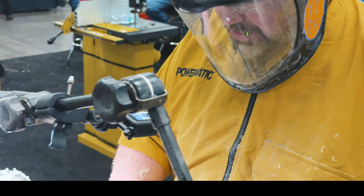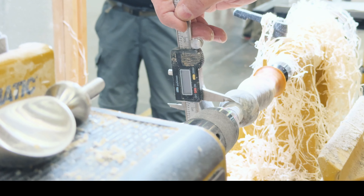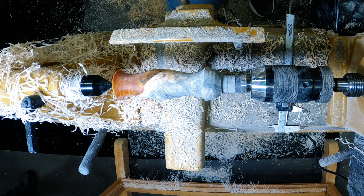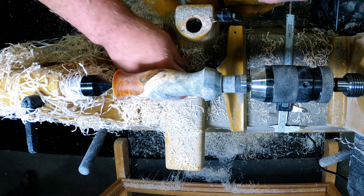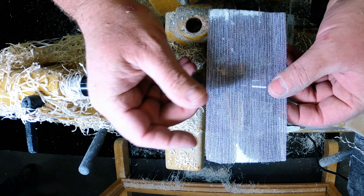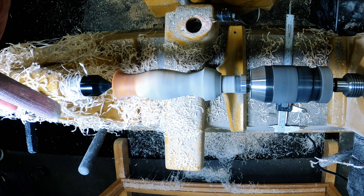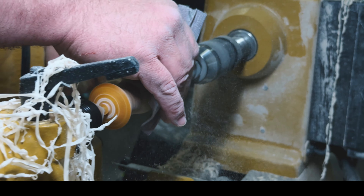One last check of the feel before we start sanding — yep, that's got a really good feel to it. Double-check all our dimensions — yep, right there, that's going to fit on there perfect. Now it's time to sand. We've got a nice little shape in the front and a double stop on there. When we sand, the first thing we always do is remove our tool rest — we never want a point where our hand can get jammed in there. So we're going to start off with 120 grit.